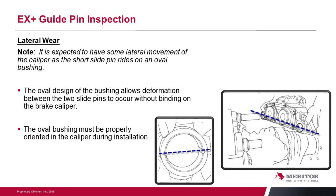Here's showing that bushing — and because of that oval shape, you need to install it correctly. If you look at the bushing itself, it has two grooves cut into the side, and a lot of times people think those are for grease relief. They are not. Those grooves are there to help you align the bushing. You just want to use those visually so that bushing is as close to horizontal on those two guidelines as possible. That gives that unit the freedom of movement and stops any chance of binding up.